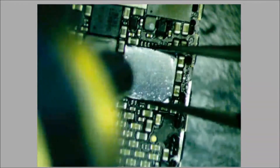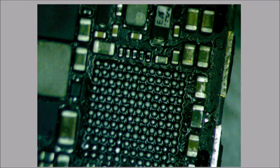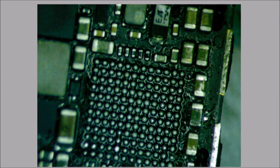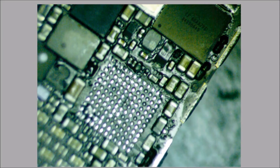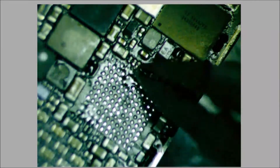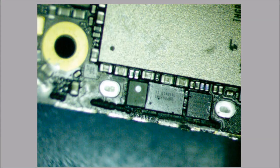Before I go ripping all of these little caps off, I'm going to check under this audio IC. As I was told by a little birdie, there's a possibility that could be the problem. Since I can't get heat to show up even by injecting voltage straight onto VCC main on the opposite side of the board, this is a good place to start. That came off pretty okay. Do we still have our short? We do still have our short. Let's put that audio IC in a safe place so we can remount it later. There's this tiny little cap — he is also on VCC main. Let's test again. Still short. Let's keep hunting — I guess we're going to start looking around Tristar and Tigris now.